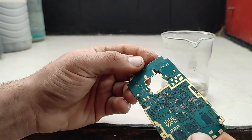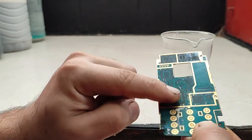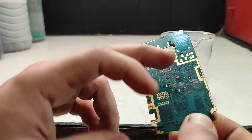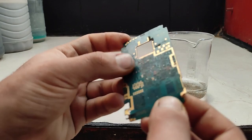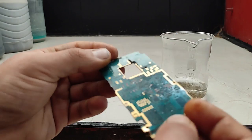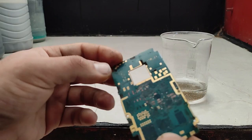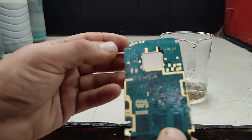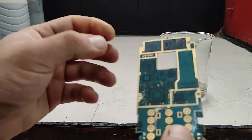I mean you need a uniform thickness of solder all the way along this PCB, because any difference in solder thickness in different parts causes dissolving of copper on the thinner part, since the thinner part will be digested much faster than the thicker part. That way you will also lose some gold foils, because this solution has an inhibitor to slow down digestion of copper, but it doesn't completely stop copper digestion. So what matters here is time. You need to select your components to minimize the time needed for leaching solder.